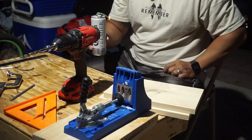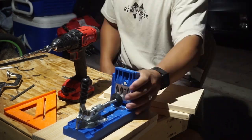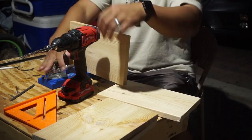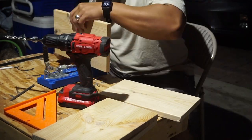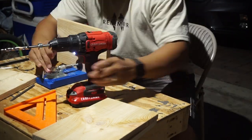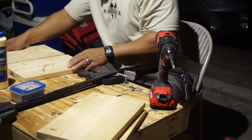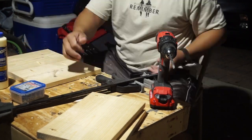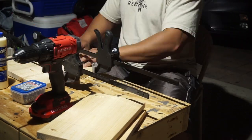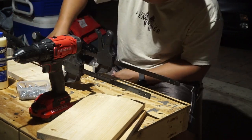It did get dark and mosquitoes came out, so I lit up some mosquito repellent. On the pocket holes, using the Kreg jig — since the two boards are going to be joined on the long edge, I have two screws coming in from one side on one of the boards, and on the opposite board one coming in from the middle from the opposite direction. Glue it up, don't clamp too tight so the boards don't bow, then drop the pocket screws.